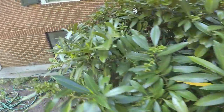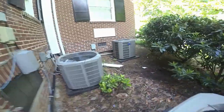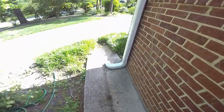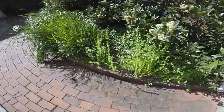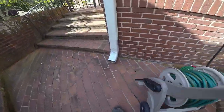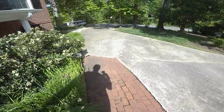We caught these gutters and everything's got great fall to it - more than a full bubble. Over here the landscaper is going to bring in some pine bark nuggets or mulch to cover this all up, but again the goal was to get the water out of here. You can see where they had already poured this little sluice trying to keep the water away and that still wasn't working. Over here we extended this one out a little bit and this one as well - there's a lot of water going down there. Hopefully this will solve his problems with the flooding basement.